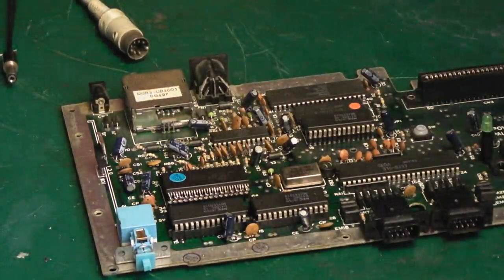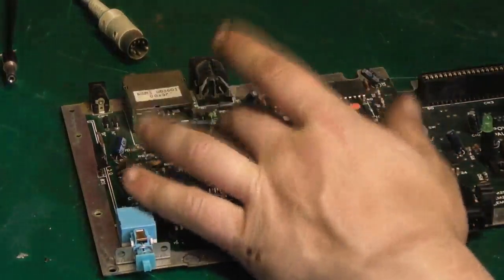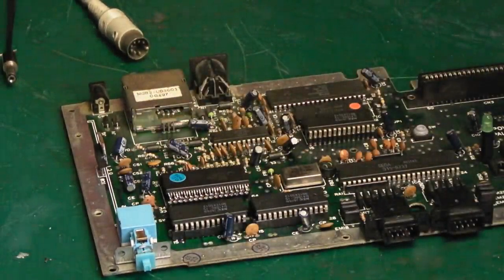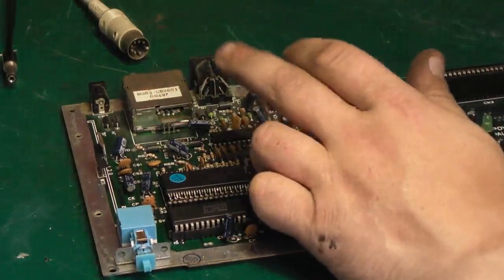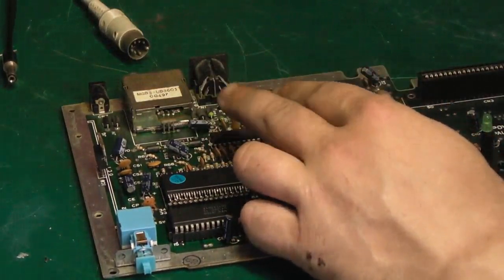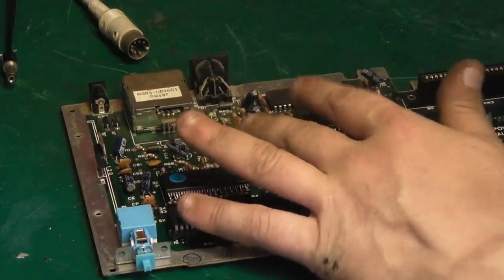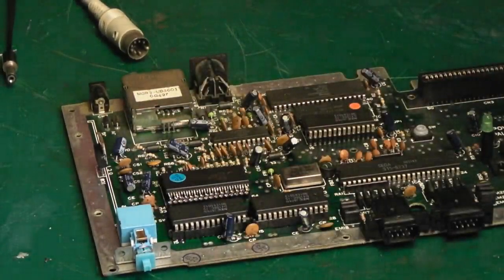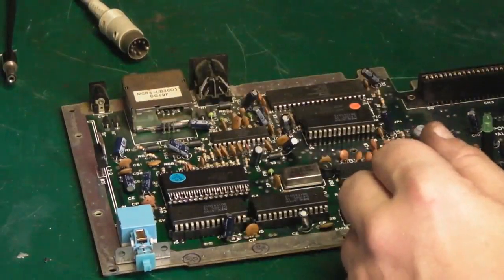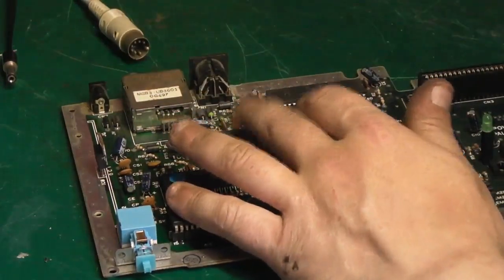So I think in the next video we will possibly be looking at swapping that out. Obviously we can't use the part off that board because that's the surface mount version of it. But I have a feeling that's the same part as used in a Mega Drive. And I've got a couple of scrap Mega Drive boards, I think one of which has that type of IC on it. I'm not 100% sure it's the same, I will look into that. Because basically that and that are the only active components which I haven't changed that I could think could possibly cause this problem. So in the next video we'll be swapping that out and then possibly that out.